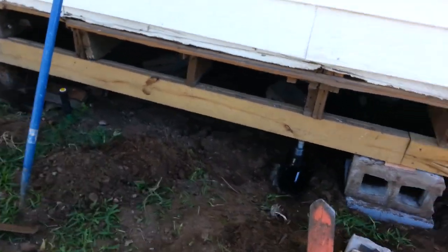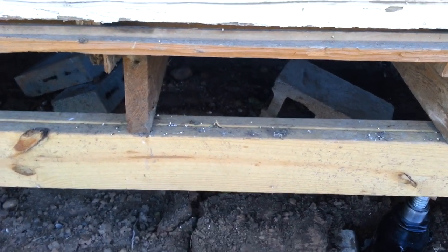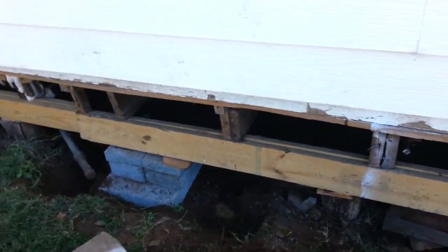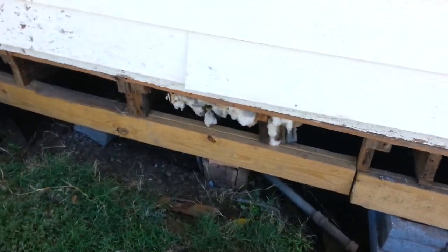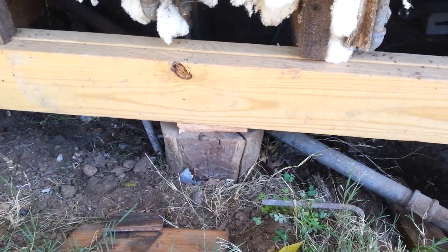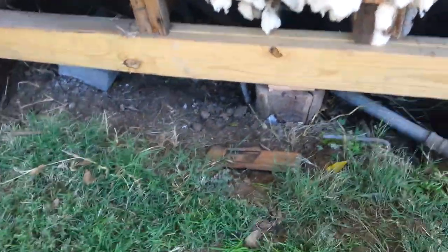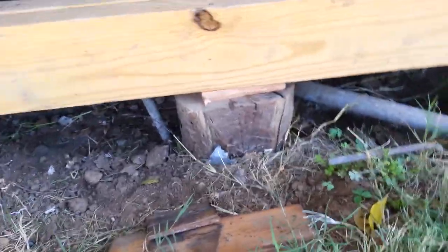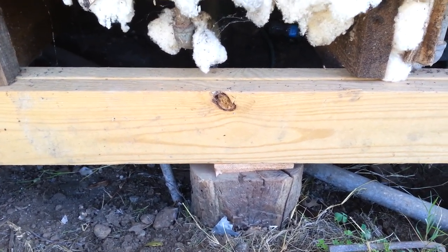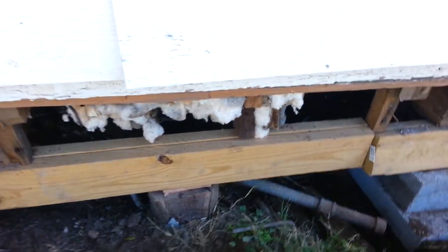In some places I'll actually put the quarter-inch steel between the concrete and the wood because the termites aren't going through that. It's really important that the beams be made out of two-by-sixes and that they're two boards in width. I place several jacks — here's one of the old bodark posts, the piers, that's drilled far into the ground, it's still really good and I'm using it. I put two chunks of cedar fence post between it and the beams just to keep it level.